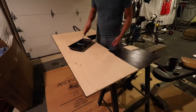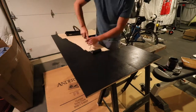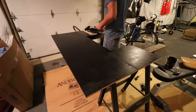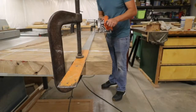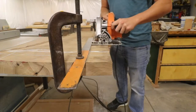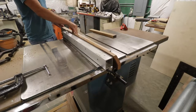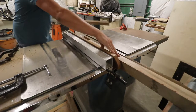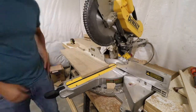Then I moved on to paint the plywood sections black in order to match the legs that were going to be put on the desk. I needed a small section of English walnut to separate the upper and lower plywood sections, so that is what I'm cutting here. Here I'm making angled cuts in order to match the leg's angled section on the front.